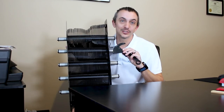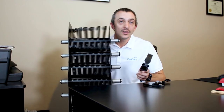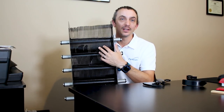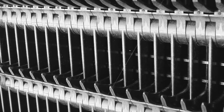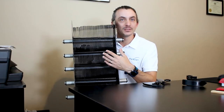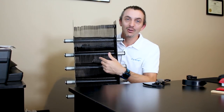The tooth on an AquaGuard element acts a lot like a shark's tooth — it can grab and hold objects, but it can also act in a sacrificial manner, where there are rows and rows available to take over if one or even a section of them are missing. The element design also features a cross-section at the base that, when aligned with all the other elements on the belt, creates a grid — the backbone of the solids capture. The teeth grab larger debris but are sacrificial to protect the actual collection grid. The collection grid is three-dimensional, unlike a screen made of perforated plate. All these levels between the hooks and the recessed grid collect solids and allow a mat to form, and that mat of solids is what really does the solids collection.